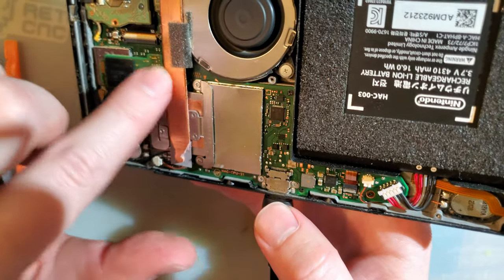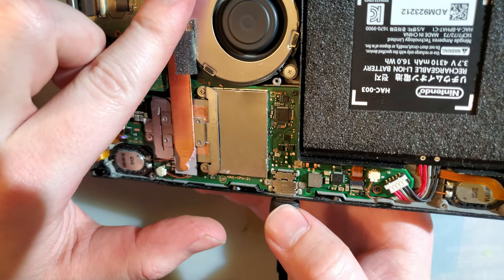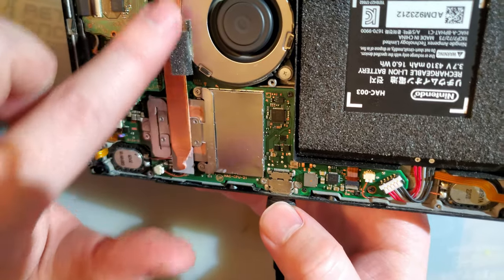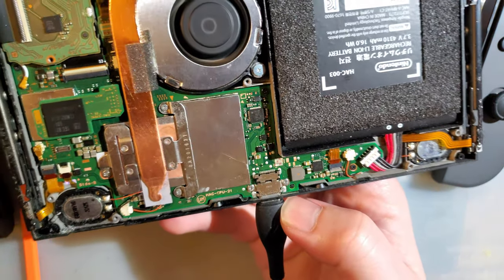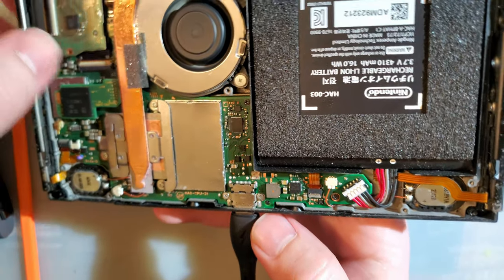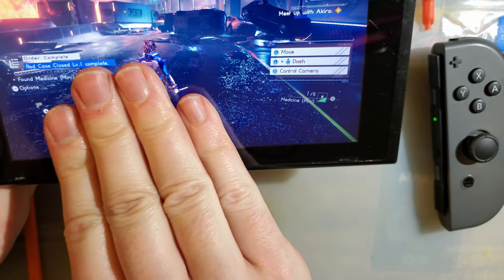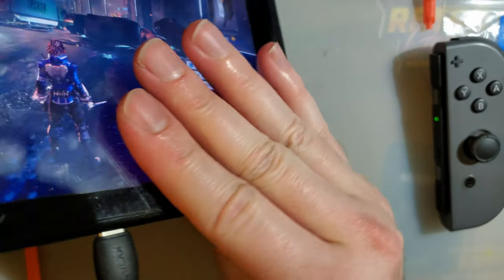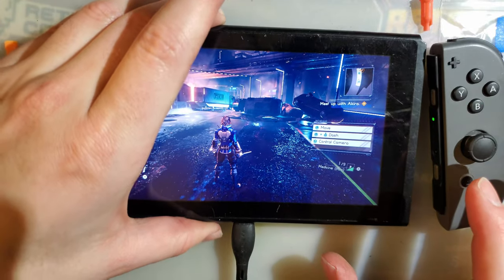We're gonna swap out this heatsink. I was worried about this heatsink not working because there was a giant crease in it, and I can just feel a huge thermal variance between before and after the crease. So I'm gonna buy a new heatsink too. But jeez, man. I felt a hot spot right here. Oh yeah, and that's right where the CPU is. Yeah, I don't think this thing is cooling properly. Lack of thermal paste aside.